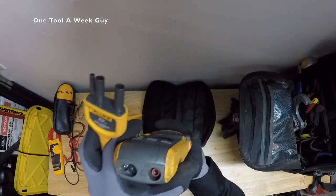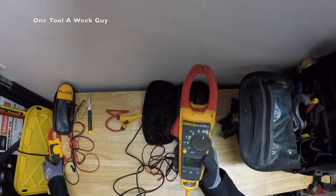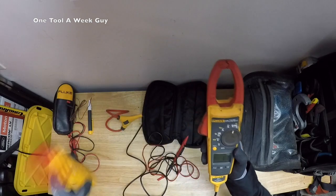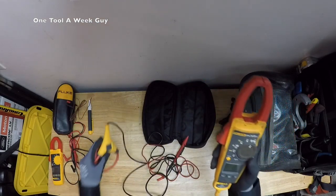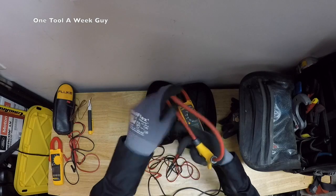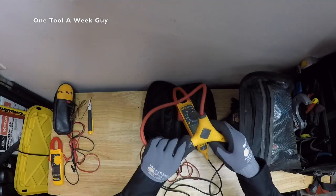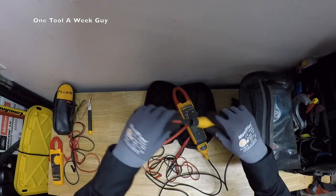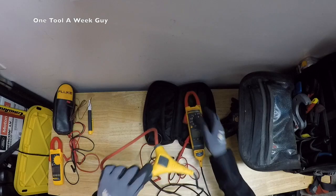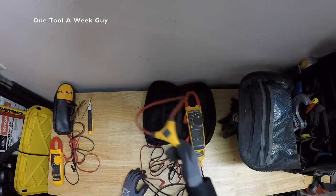The last setting is iFlex. The iFlex is a flexible connector that plugs into the dedicated prongs at the bottom of the meter. The 324 does not have this — it just has the basic two connectors. The iFlex can measure amps on wires that are too large for the jaw clamp, or if you're in a tight spot where the clamp won't fit, or if you want to get some distance from the wire — connect it, walk away, and read it remotely. That's the iFlex setting.